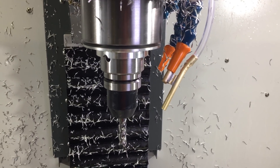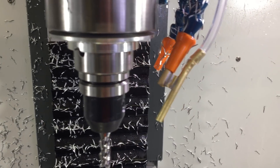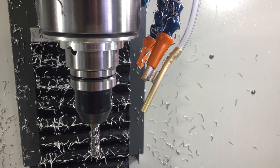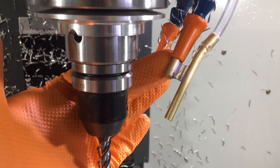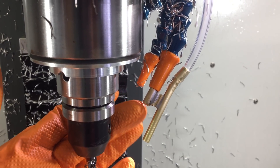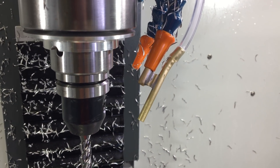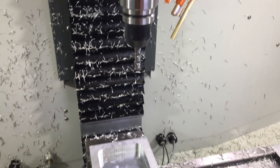So this is what I was testing out in that footage when we got that VFD trip. Here's my little prototype — air blast, lockline, coolant, two-for-one combo, all brass, artisanal grade, looking tremendous. This is a bigger lockline nozzle. I turned down a piece of brass and drilled a hole through the center of it to get the ID of the hole back down to the same size as the other one so we don't lose a bunch of pressure. Then I bent up a piece of brass tubing and soldered it together.